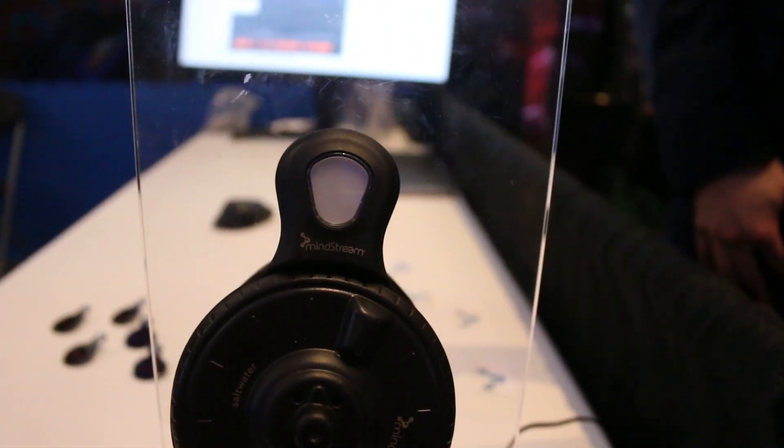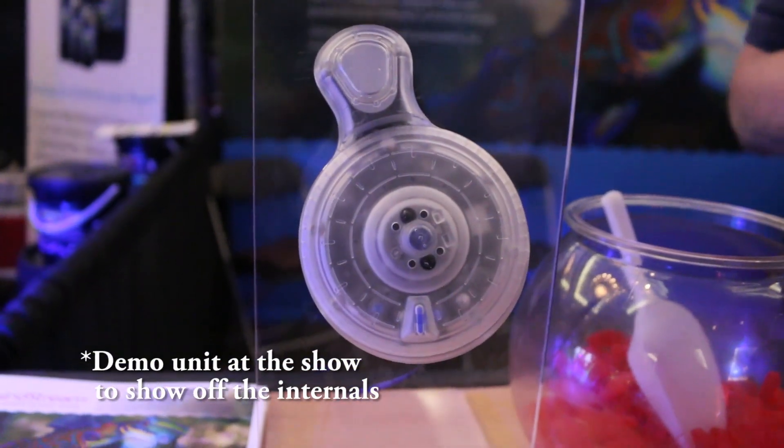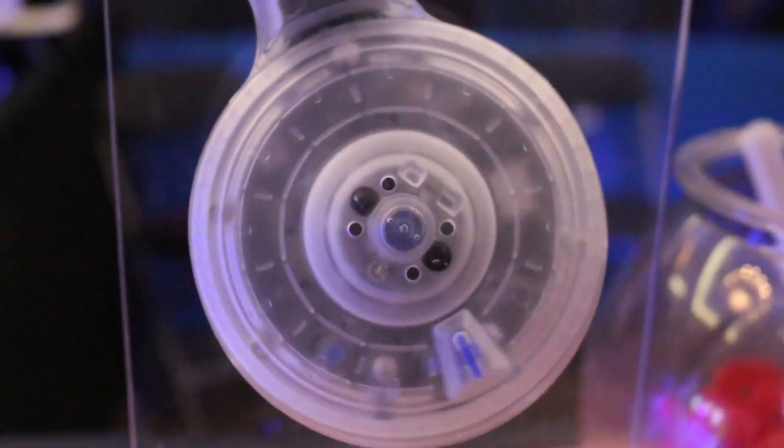We're adapting a technology called Fluorescent Indicator Science from the medical field. We're using little tiny sensor foils as opposed to reagents. There's no plumbing — we don't take any water out of the tank, we don't generate any waste water. It's all based on this little disk. The monitor monitors these little sensor foils. The way it works is we shine a blue LED light underwater, the light hits the sensor foil and fluoresces, and then we measure the intensity of that response — basically how bright it is — and that tells us how much of that substance is in the water.